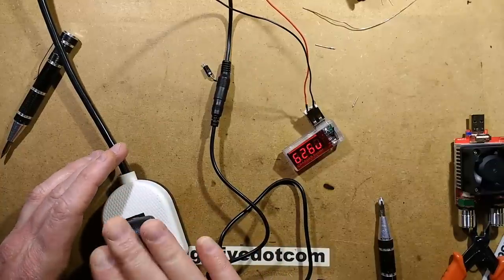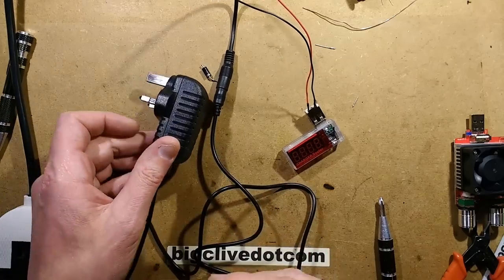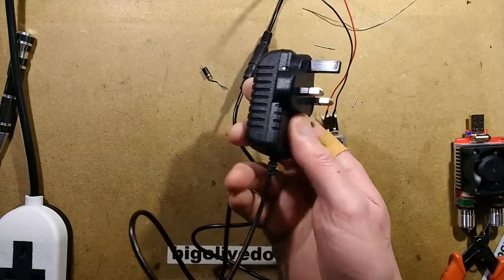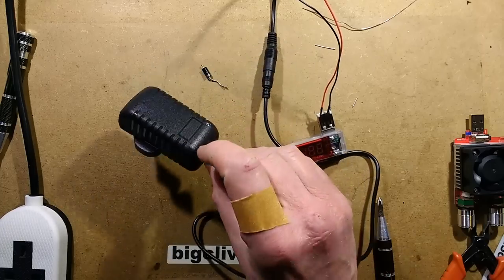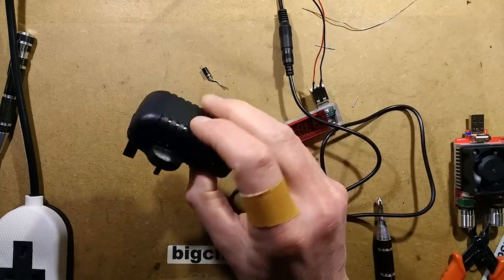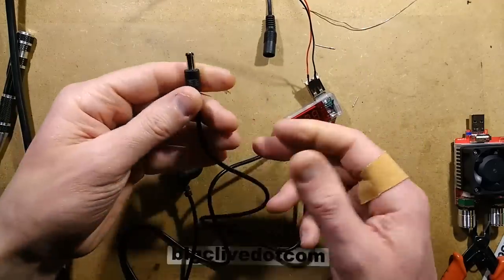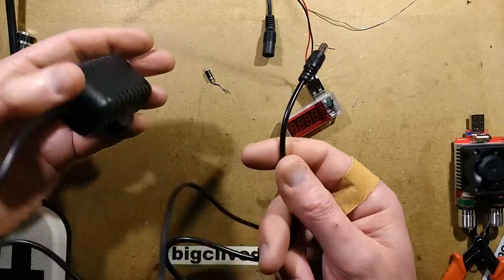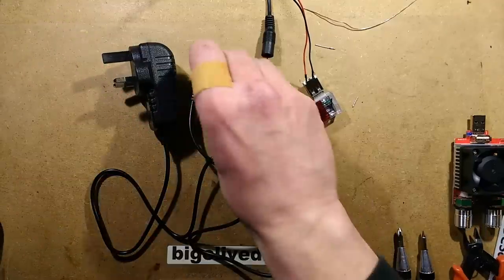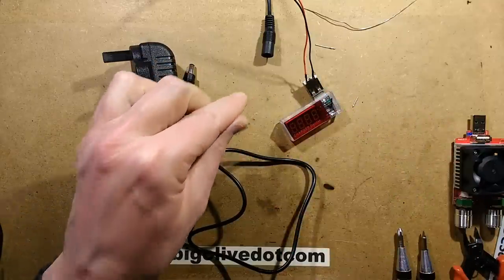And it's back — but still, I wouldn't use it. The bit that had failed was the diode, and it's obviously got protection in the driver chip against a shorted output. Would I have one of these power supplies in a kid's bedroom on an appliance? Probably not — I don't think it's good enough. I'd want to find a better quality 6-volt 2-amp power supply with the standard jack and use that instead. But it was interesting to look at, and interesting to see the failure mode — once again it's the diode. The diodes always fail in these power supplies; it's such a common fault.